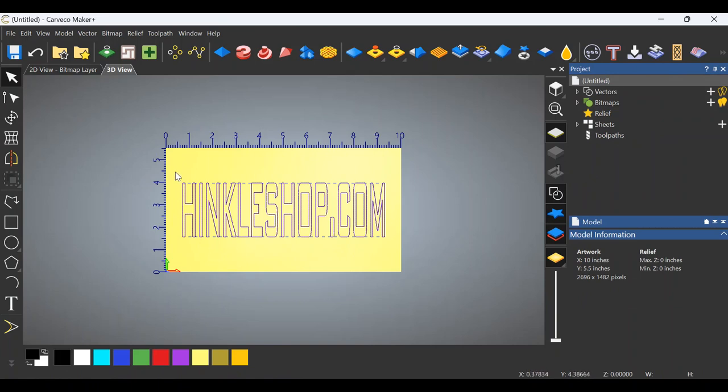The next thing we need to do is create a square around our work area. You can do this close to the text so that it only removes around the text, or you can do your entire work area — that's entirely up to you. Before, when I said I was going to make step downs, I would have created the box around the text, done the area clearance on that box, created another box, gone a little deeper, all using the area clearance toolpaths. It would create a step down or pyramid effect to the letters. I'm not going to do that here because I want to keep this simple. The premise is to show you how this is done, not how to get too fancy.